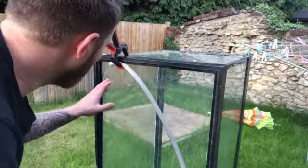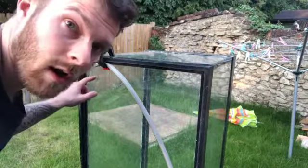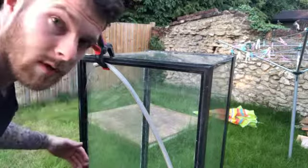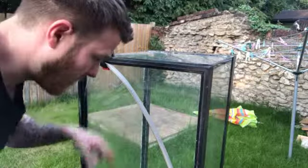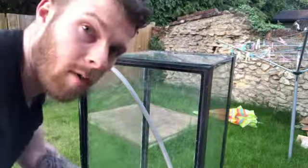Another point, so I'm halfway through now. I'll just stop because I just realized I hadn't put anything in the base of the tank. I've now just put a pillow in the base of the tank there, because when I break through the other side of the glass, the bit I've just cut out is going to fall inside. Some people use tape to secure it on the back. Because I've got the tank up outside, I'll just put a pillow in there that's just going to catch the glass and stop it from potentially cracking the bottom pane as it falls through.